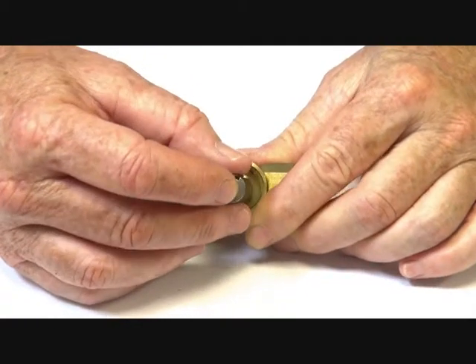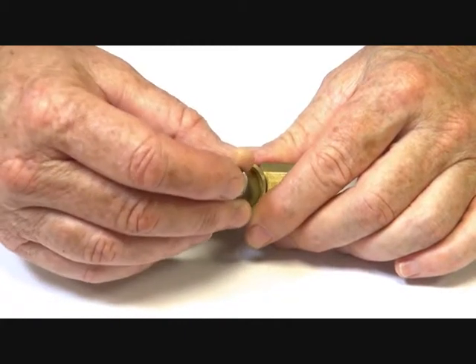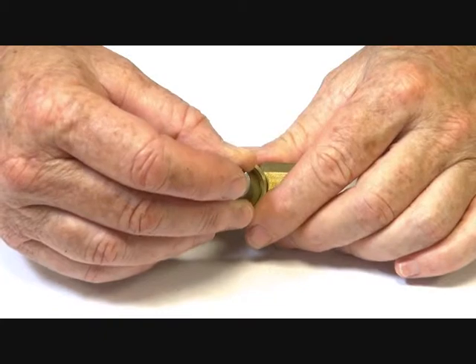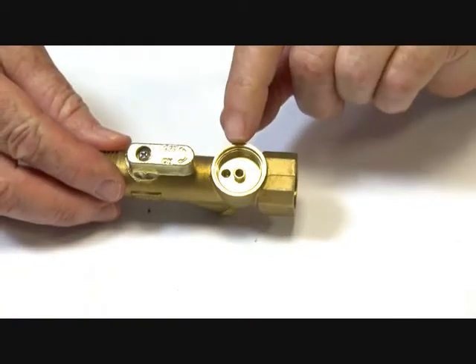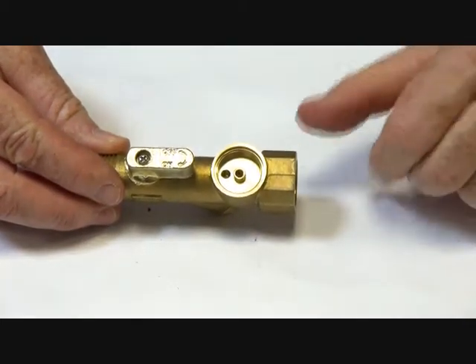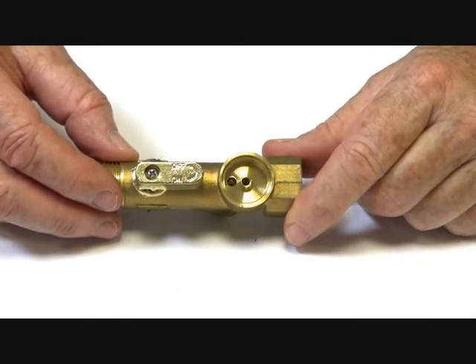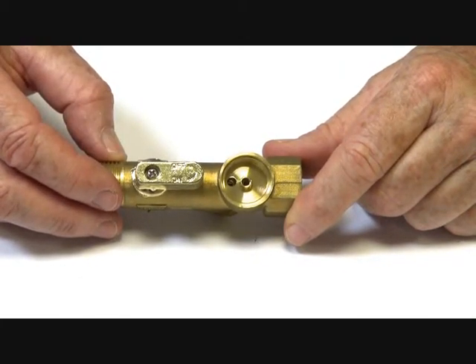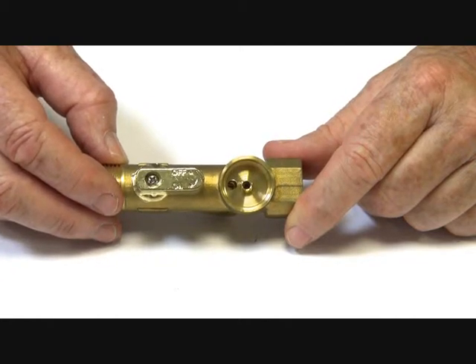This assembly sits on top like that, with the spring and air pressure holding down the media pressure. In this case it can also be used for liquids — it holds the unit closed. When the solenoid coil is energized, it lifts up and the liquid media goes downstream, vented away to drain. It's suitable for drop legs and low points for condensate removal on most air service equipment — ring mains, compressor receivers, and drain points anywhere in a system where you want to remove condensate on a timed, controlled basis.